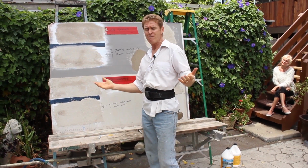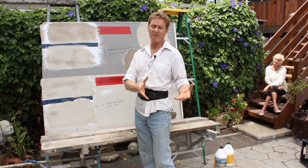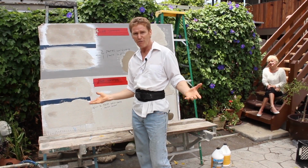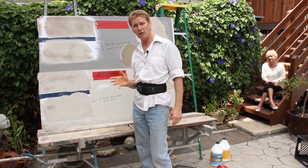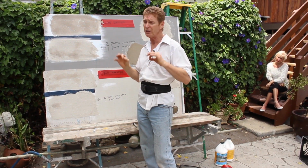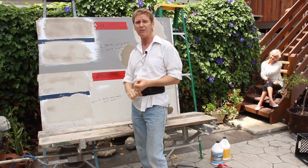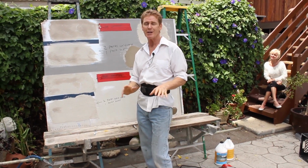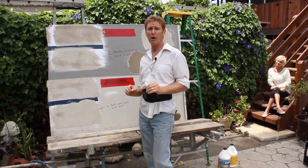That's like putting 5 to 1 with cement. We use 5 times the amount of sand to save money. You don't save any money if that wall falls down. You cost yourself a fortune. So I do not dilute this to save money. I dilute it because I know what I'm doing, and every job is different. So you guys do what's on the label, and most of you homeowners, you DIY guys, call a licensed plastering contractor if you're going to do a color coat, because this is just the tip of the iceberg on a color coat. There's so many different things that could blow a job.